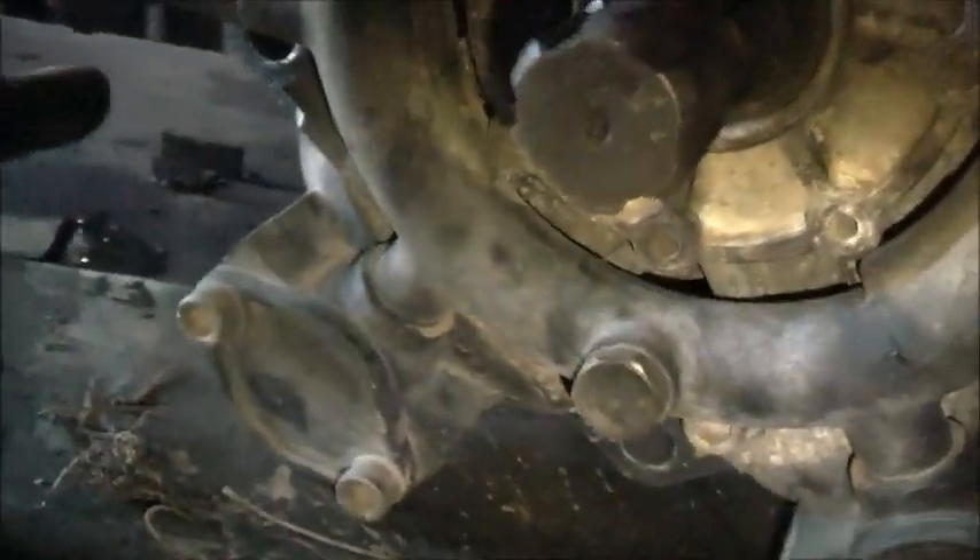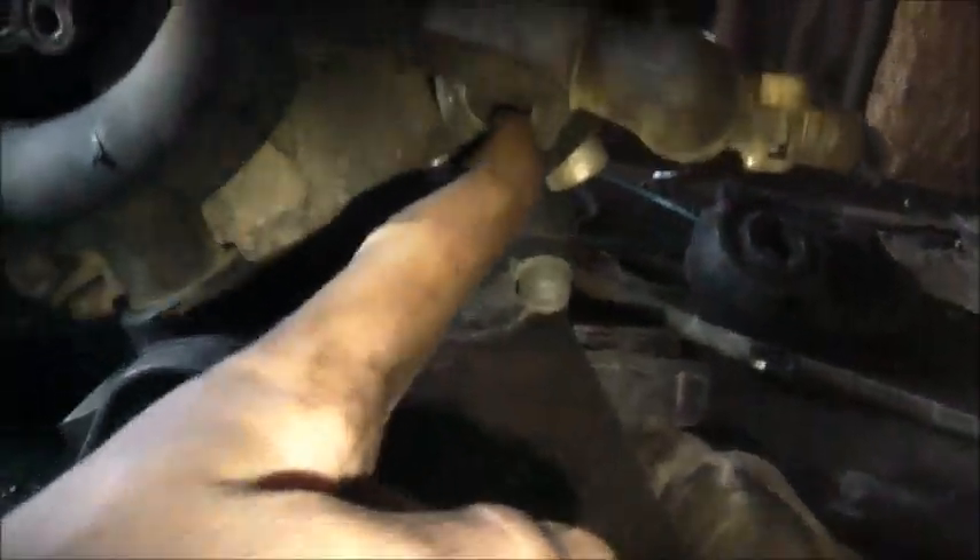Lucky we can get a new one of those easily. To fix this, we may have to put steel sleeves in there — a steel pipe right in there, a sleeve — then put washers or something to try and take up that plate. We can fix it that way, depending on what the customer wants. This is all fixable. But these bolts were not done tight enough, there was a bit of play, and this whole pump was moving the entire time the vat was operating.